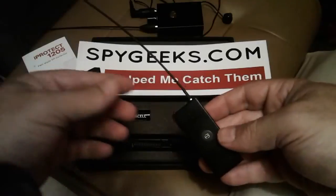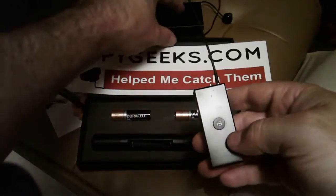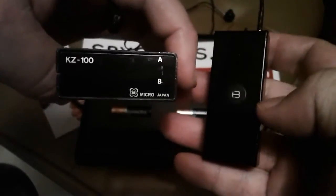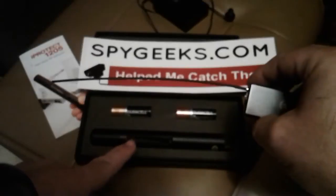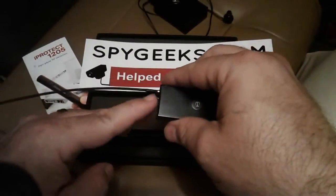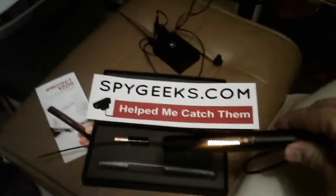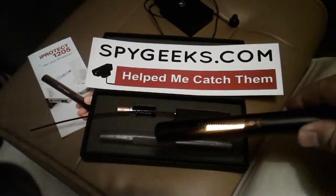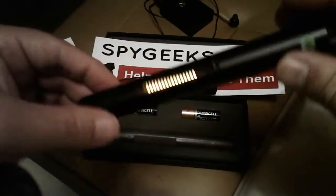Here we have the real deal — this is a real bug, known as a five-day transmitter. It would transmit to this receiver and you could be a half mile down the street. For all you tech heads, that's a real KZ100 made by Microtech in Japan with a matching B transmitter. These are not for sale — law enforcement only. We use these to test our equipment. You can see the bug detector is on with no lights, but right when I turn the bug on — there we go, see the lights come on. It looks like you have to be about a foot away. This transmitter is on UHF at 398.605 megahertz, and this bug detector is picking it up across the bandwidth. It's definitely worth the money.